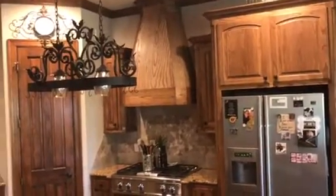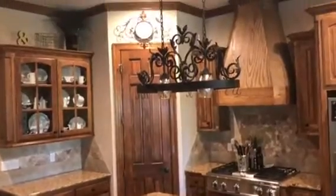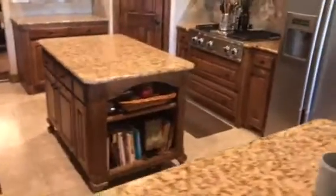We're going to change all of these cabinets in here. They're all going to get primed and painted, which includes sanding, cleaning, and finishing — what you call caulking and wood spackle if you will. All these areas here where two pieces of wood come together, we try our best to make sure that doesn't show up when it's painted, but we do not guarantee because sometimes it's just impossible. We do try our best to put wood putty inside each one of these and sand it down and get rid of them. We do caulk in every one of these areas where these seams are. It's hard to see the shadow now, but when these are white, if that's not caulked in, there's going to be black lines that are shadows.